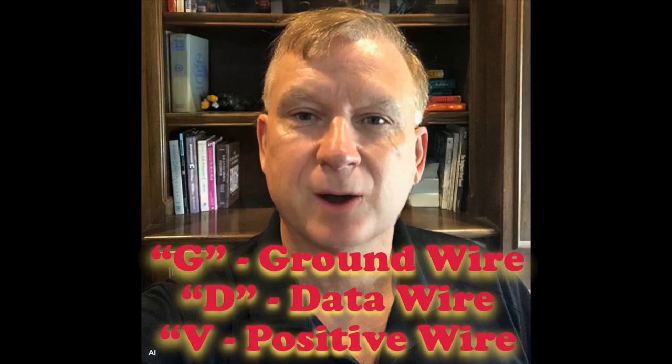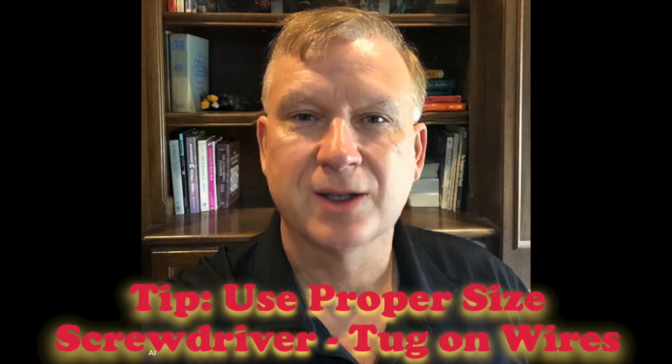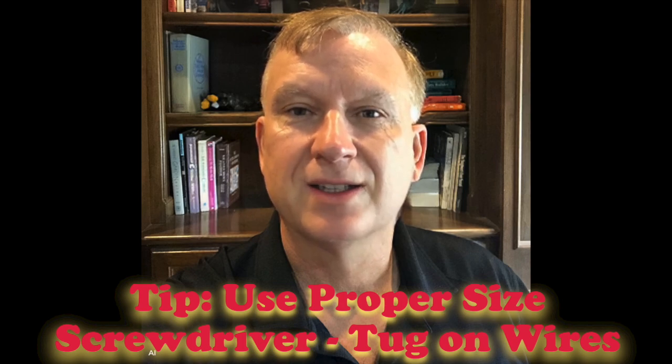First, I'll wire up the controller for bench testing. I will add my power supply leads to the positive and negative screw terminal block. I'm using a 12 volt DC power supply, but the controller can also be run on 5 volt DC. Be sure to check the voltage selector next to the black screw power terminal so that it is set to your supply voltage before applying power. Next, I'll connect my pigtails to the green pluggable Phoenix connectors. In my case, I'm using X-Connect connector pigtails. Make sure you wire the Phoenix connectors properly — the connectors are clearly marked on the controller. The letter G is for ground, D is for data, and V is for positive. Be sure to use a proper size screwdriver to ensure the pigtail wires are tight and securely fastened. Give the wire connections a good tug to verify.